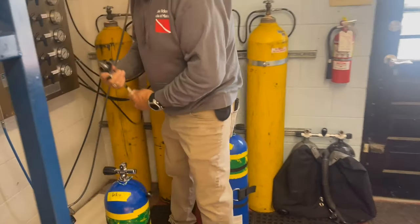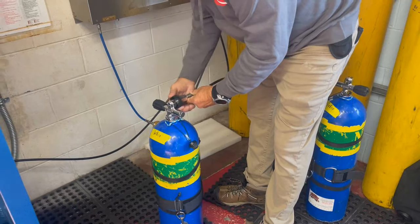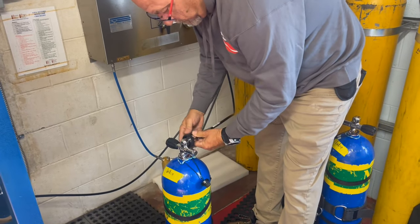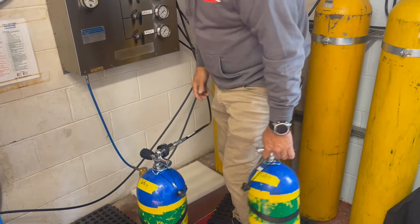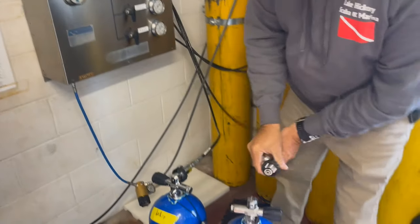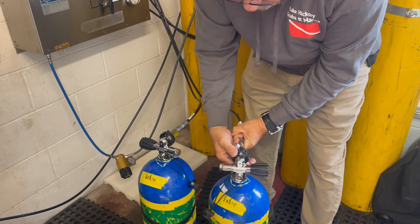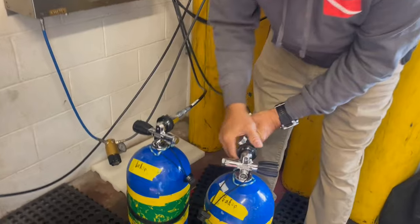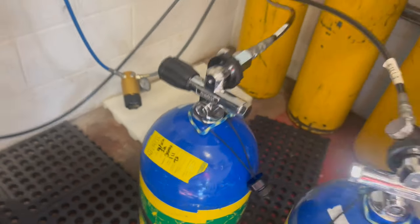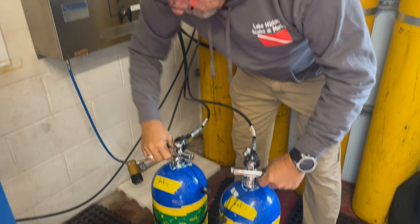All right, so now that we've got the O2 added that we needed, we're just going to add 21% on top, get us back to the 32%. And then, of course, if you guys remember from the last video that we did on partial pressure blending, we will monitor the O2 and, of course, remark the cylinders, make sure that everything's good to go on it. And we should have our 32% mix.